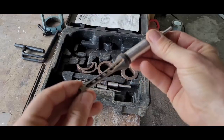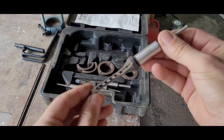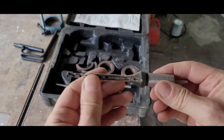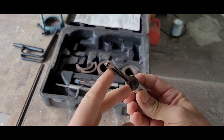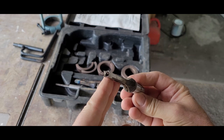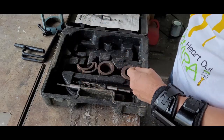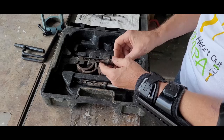and the hollow chisel sets. Each consists of an auger bit that removes most of the waste and a matched hollow chisel that squares the corner of your work. The kit comes with 1/4 inch, 5/16, 3/8, and 1/2 inch chisel sets.